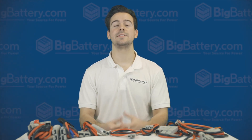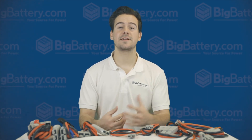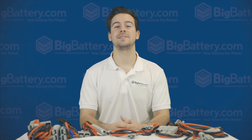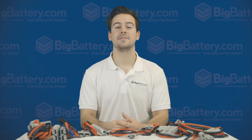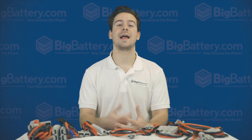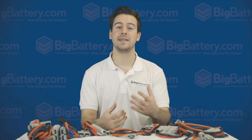These cables use 6 and 8 gauge wire respectively. Now, some of you might be saying: won't that gauge wire not be rated for the kind of current your battery puts out? That's a valid concern. However, when working with smaller gauge wire, the length also determines its limits. In our batteries, the short length of our wires allows a smaller gauge to be used for a higher amperage. There is also the SB350, which can handle very high current systems, should you be in need of it.